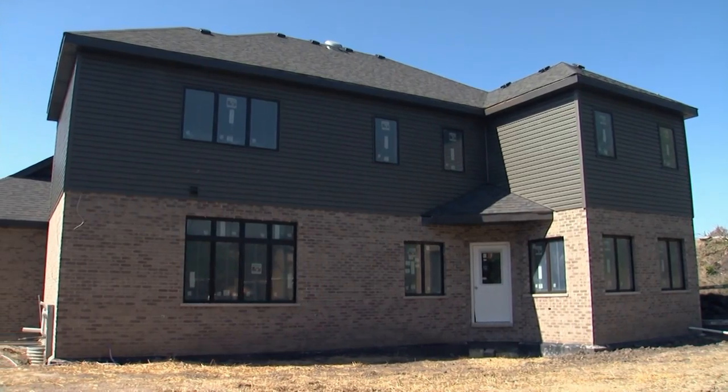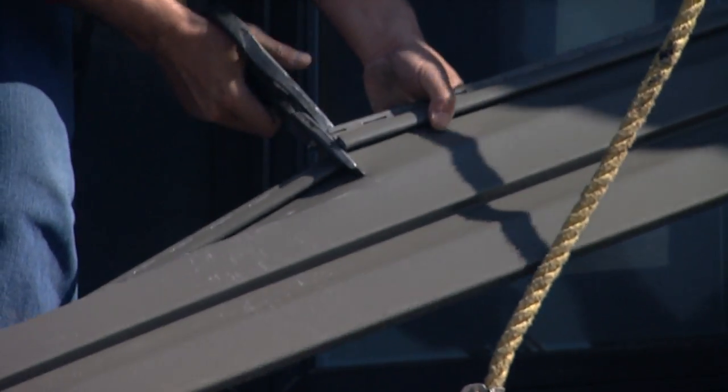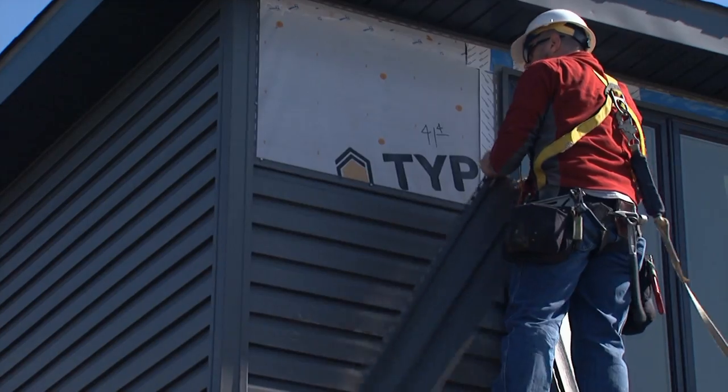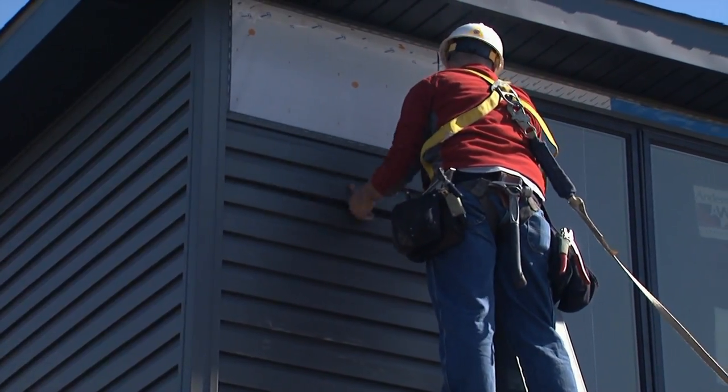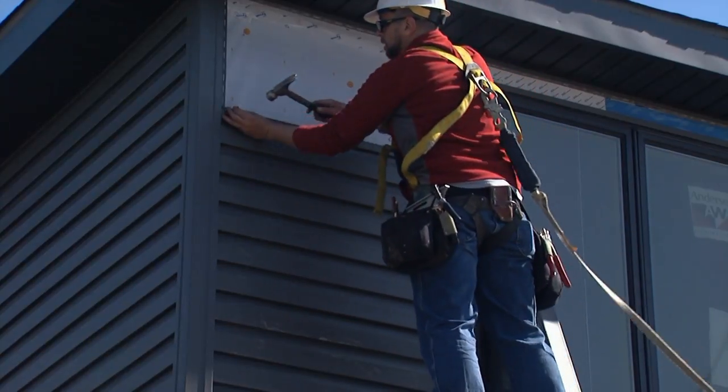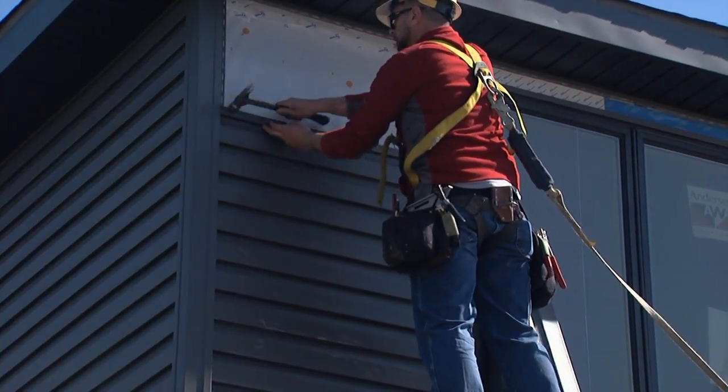It gets more complex as you add — in a house, everybody can relate to a house — you may have siding on the outside, that's your bulk water management. Behind that, you have some sort of air control layer nowadays. That could be any of a number of different sheet products. This one's got a crinkled surface to it. This one actually has some ribs, and that's trying to promote drainage behind that cladding, because some water eventually works its way through. So that becomes one element — it's a two-fold product.